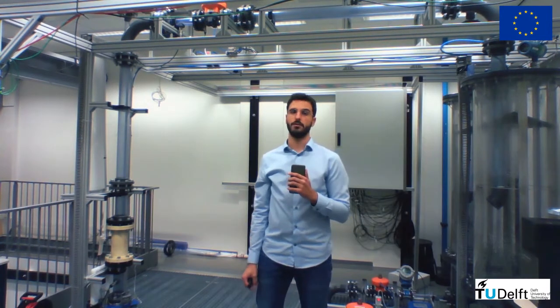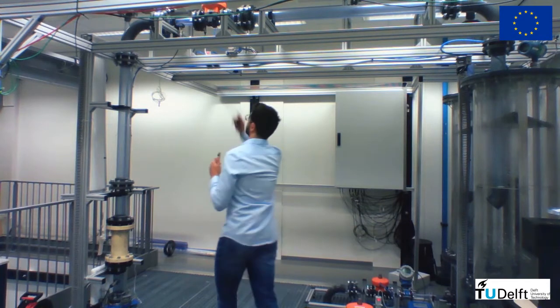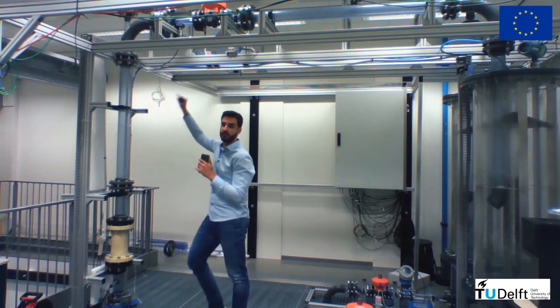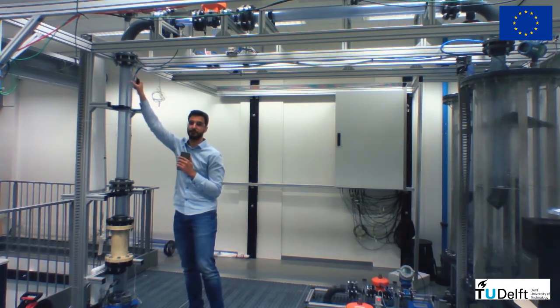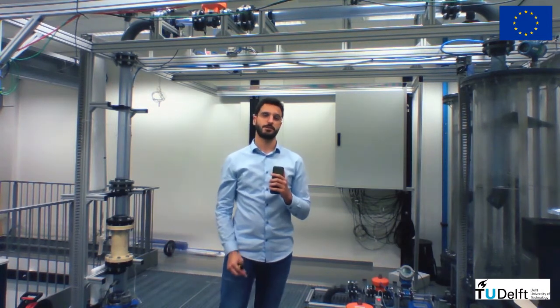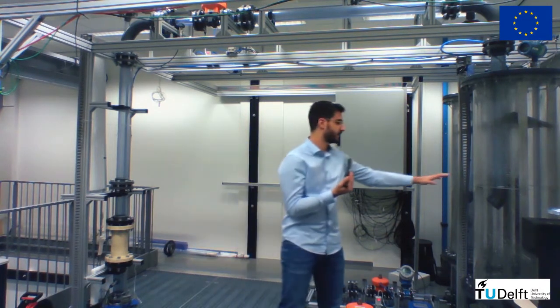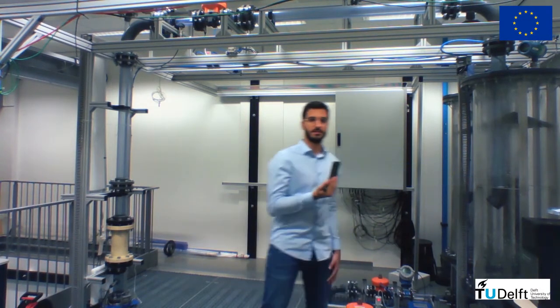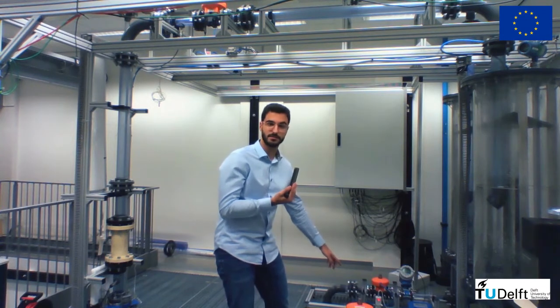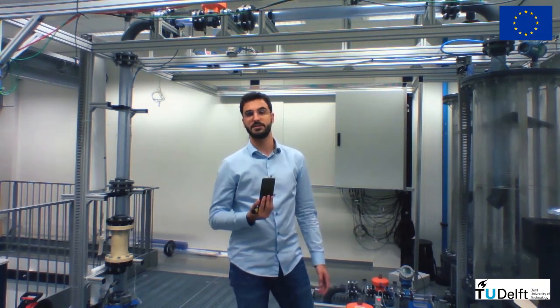The main goal with this setup is to try to adjust the valves in real time to make sure that we're always capturing the best amount of air possible in the pickup tube with the minimum possible amount of water. Our separator ends at the valves, but in this setup we still have these tanks right here. These tanks have flow meters of air and water individually that allow us to compute the efficiency of separation.